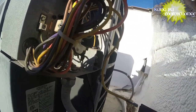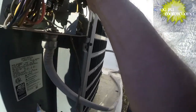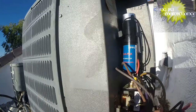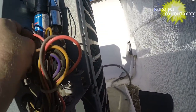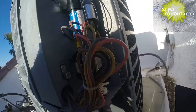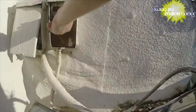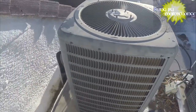Now we can plug in the yellow start wire — nice tight connection there — and then this red run wire. Our nice new wire terminals should do much better. And we're ready to run. Well, hopefully it's not low on Freon on Friday — you know, blazing sun. Here we go. Light. No compressor. So we've still got an overheated compressor. We're going to need to pull those and let it cool down longer.